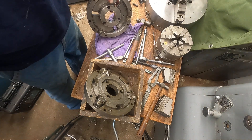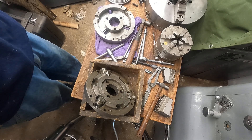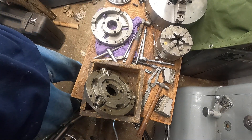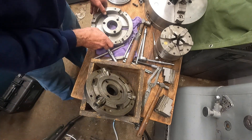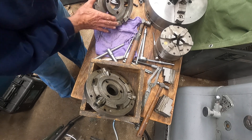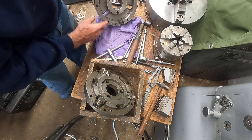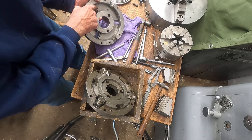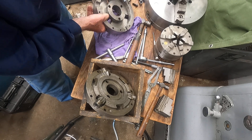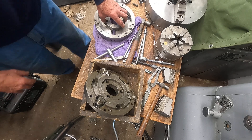To fix this, you put the front part on a face plate and resurface it, get it running true. Check it internally and externally everywhere and use your best judgment getting it running true, then remachine the thrust faces. There's usually quite a bit of relief there, so you machine that true.